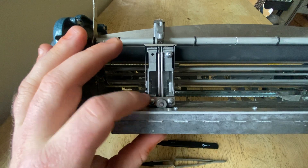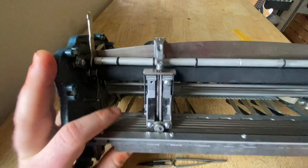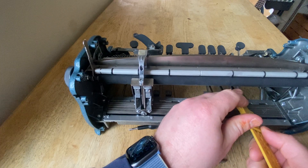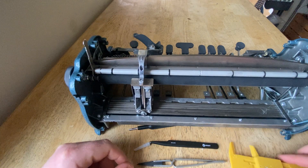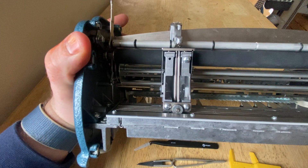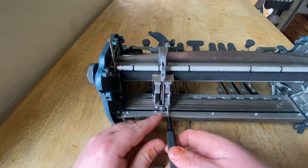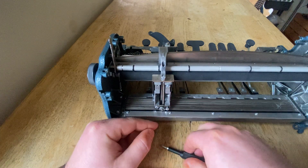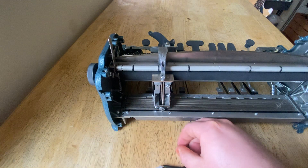At the same time when you press the space bar, the mechanism advances and clamps down the die box onto the embossing head to make that Braille paper sandwich. So imagine this little tower is on two wheels and these wheels roll along a track that's 11 and a quarter inches long. I'm going to take the side panel off the lower part of the embossing assembly, which has the wheel on it, so we can get in there and see the little skate that all the steel rods are mounted on, and then hopefully put it back together again.